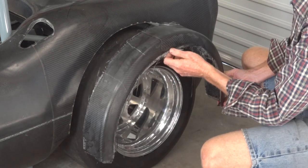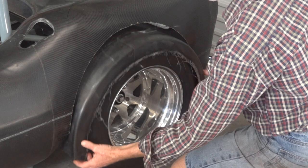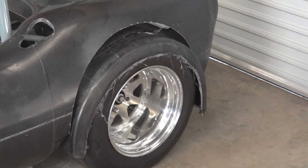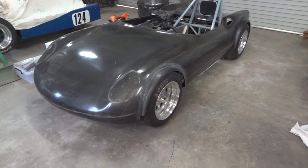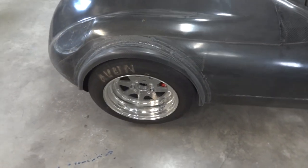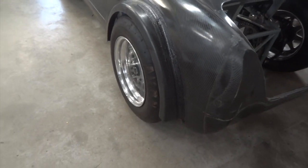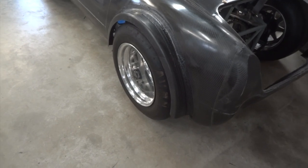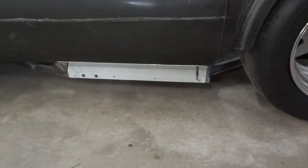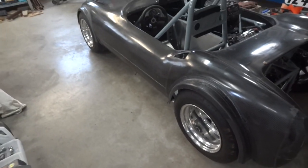Unashamedly copied from a 289 AC Cobra — here's our little wheel arch moulding. It tidies things up enormously. Here are our finished wheel arches laminated in place, just about the width of the tyre and filling up that big gap we cut out before — front and rear. Just a couple of strips of carbon wet laid up over the joint, which looks a lot more tidy and adds a huge amount of stiffness to the body. And to hold the sides of the body in place, some little sills down there, also so you don't see the SpaceFrame chassis poking out. Just about ready to drive it.